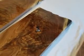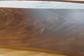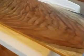Now just putting a raw 2K 35 degree with no sealer on this board, it's pretty dead looking. Doesn't pop the grain whatsoever. I think on the other side, this is with a sealer, and again 35 degree top coat, no Watco oil. So that worked out pretty good.